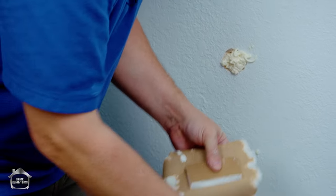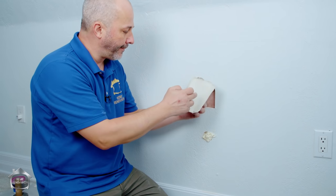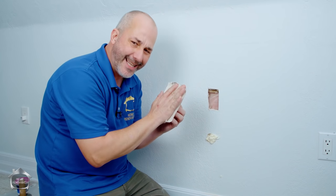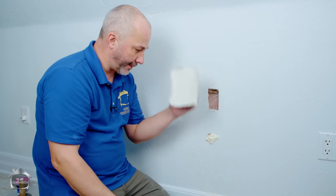This makes an incredible patch because the paper attached to the drywall is thinner than drywall paper tape. When you do your patch you want to keep everything as thin as possible when retexturing - you don't want to have a hump or a bump, so this is what's going to work.